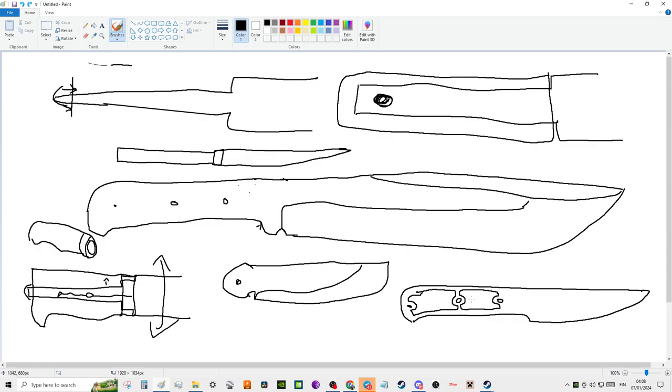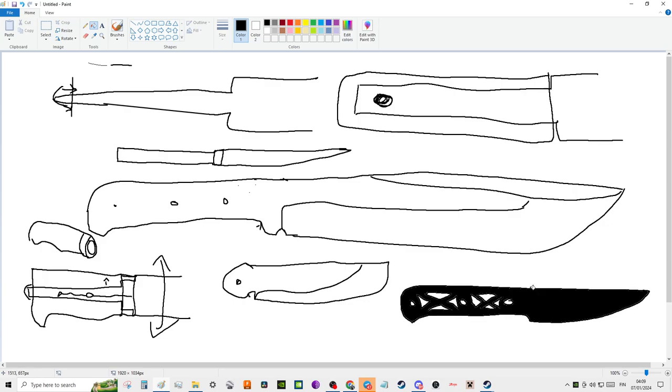And the thing is, you can make your skeletonized handle much stronger, significantly stronger, if, let's just do the holes first, just to make it easier here. If you do something like this, where you have essentially what are cross beams that you see in construction and girders, this is going to be a better option. So let's see if we can fill that up like that. You see that? That is significantly stronger than just a basic skeletonized handle.